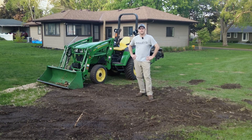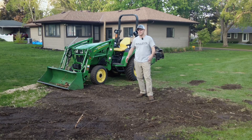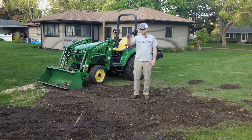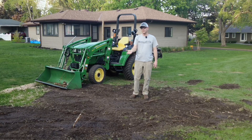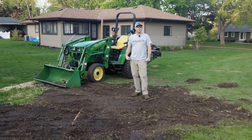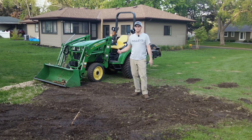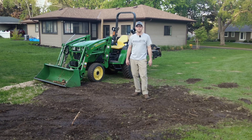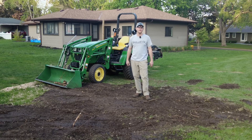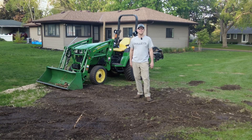Unconventional, yeah — I'd rather have a mini excavator, but I don't own one. I own a tractor and a stump grinder, and you saw how I did it. The technique: take out all the roots on the side with a stump grinder, dig out around the side, come in and dig the stump down as much as you can, then come under it and lift it up — you'll pull the taproot out. I just don't like stump buckets on compact tractors — they just don't seem to amount to a whole lot. I'd rather use a stump grinder and the front end loader and just go at it. About an hour of time, three-foot stump — let that speak for itself.